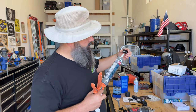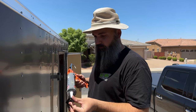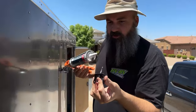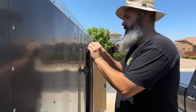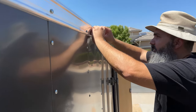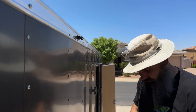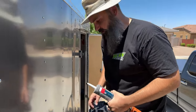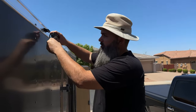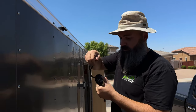I'll put just a little bit around the outside of the bracket too for safe measure. Thankfully, it rains here very little so we have far fewer opportunities for water to get in than in other locations. You can see what we're doing there - we're just wrapping all the way around to try to create a seal, and we'll push it in flush and spread that silicone throughout. We'll get our mounting nut on the inside. I'm using lock nuts so that I don't need lock washers or anything like that. I want my cord to come out the bottom so I can rotate it up and create a drip loop - that way any moisture that does get on here is going to run away instead of towards our light fixture.